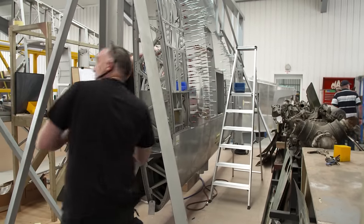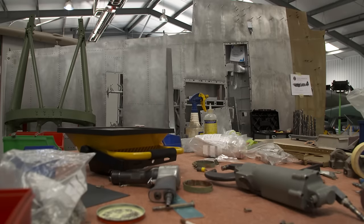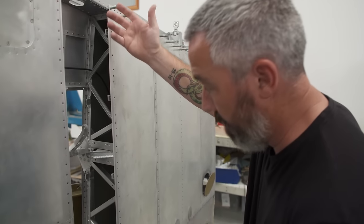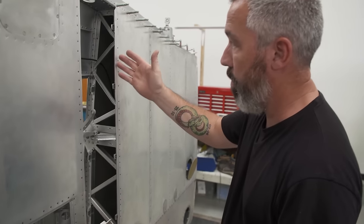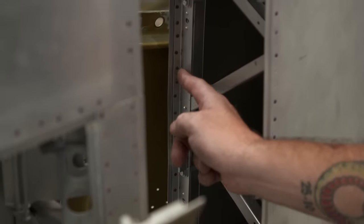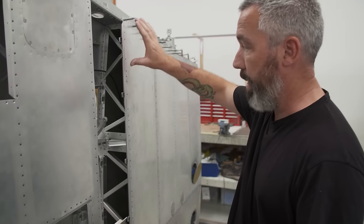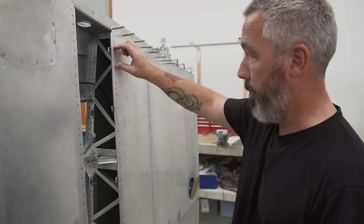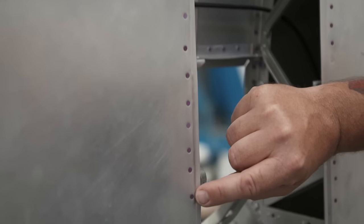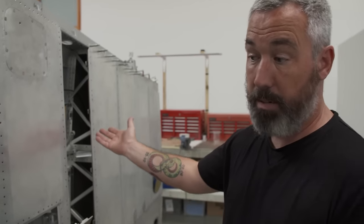Another new wing nearly finished, but the Greek Spitfire's wings have been much more challenging. A restored wartime wing is a very different beast to a new one. This was made 80 years ago, so, and you can tell it's been mass-produced. That's near to breaking through, and then it pitches back in again. So it's almost wavy through. Nowadays, we wouldn't do that. We would be pitched in, equispaced, straight lines, but not knocking it, under a lot of pressure, being bombed regularly. Back then, it was get them flying, defend the island, and that's what we done.